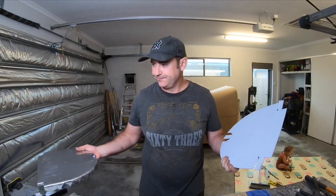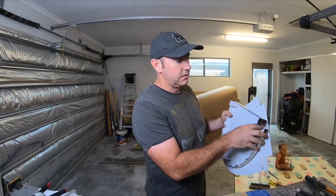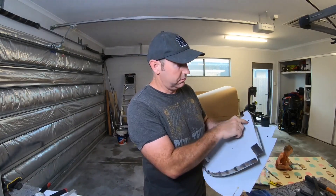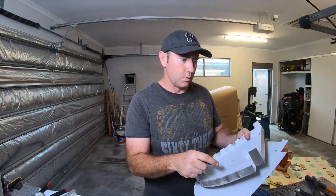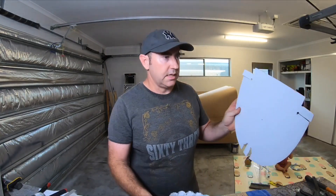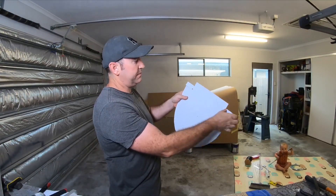So to get to this shape you've got to cut out these blank plates. Wherever you want to bend it up — I want to bend it up here — I'll put a quarter-inch drill hole in the corners, which is to relieve the stress when you're bending the aluminium. It prevents any cracking through that joint.